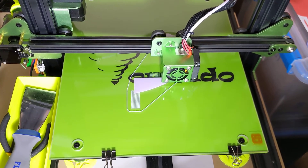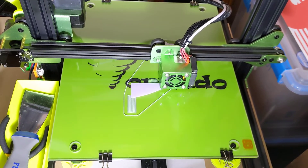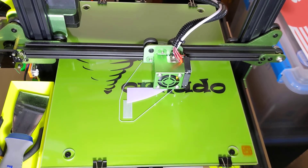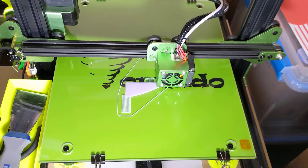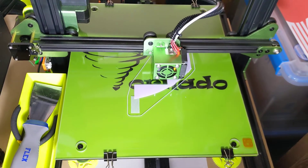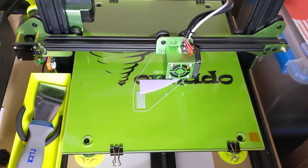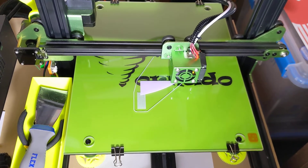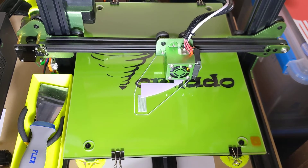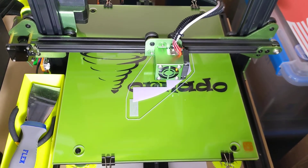The thing about the second printer is I want to make sure the settings on it are close enough to this one so that parts that interlock fit properly. If your calibration is off in any XYZ direction, the part you print might be too big or too small to fit the opening of the part printed on this printer. So I'll first finish the skirt — which has no interlocking pieces — then try a part that does and adjust the other printer, leaving this one alone. That way I can ramp up to printing on two printers simultaneously.